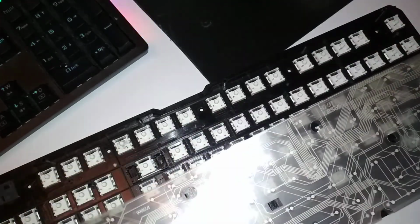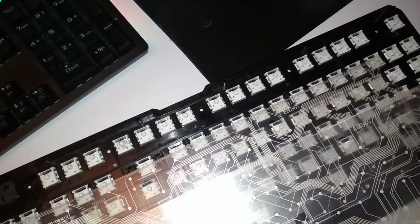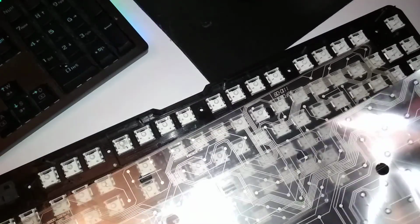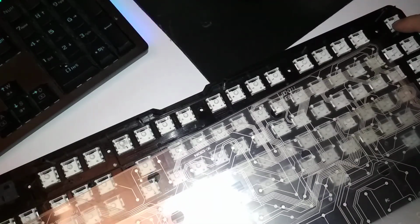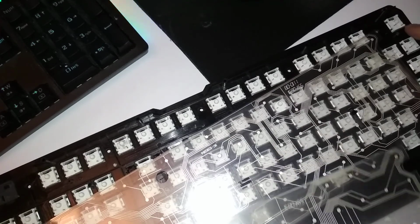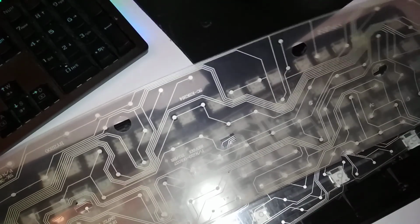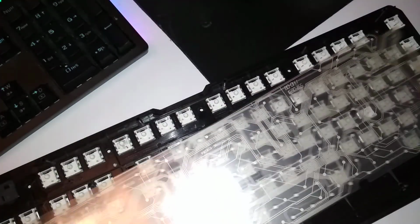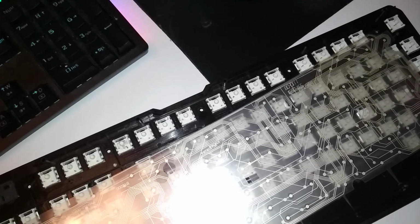So what I will do, here are two circuits, 1 and 2. One of the circuits I will connect to all the left legs of the switches, and the other one I will connect to the right pin of each switch. And where they meet, I just put some insulation between them. I don't care to have insulated wire, it will be just bare wire.